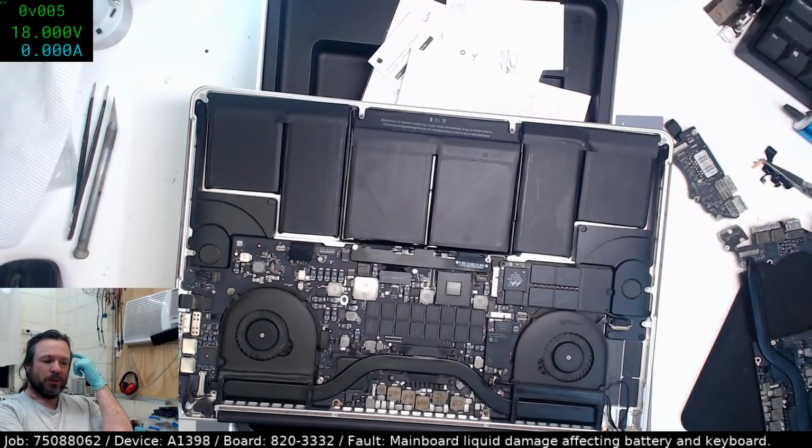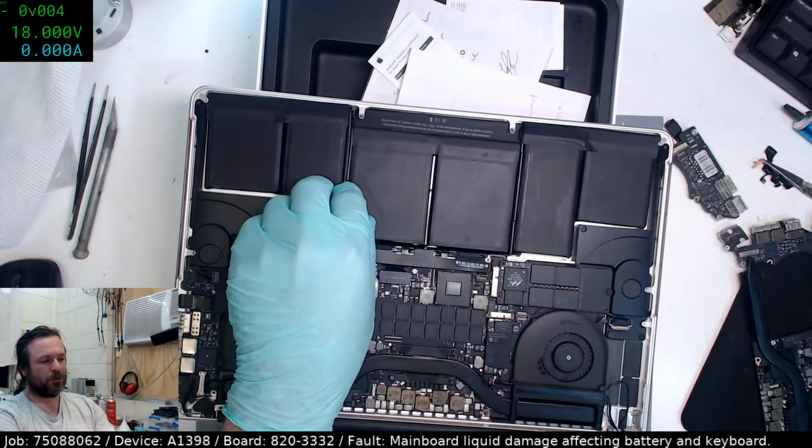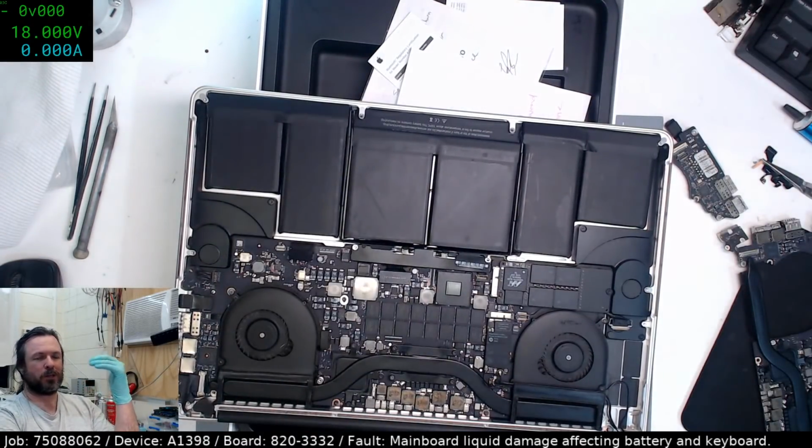You know, the reason why that's slow at the beginning stage is because with lithium packs, when you're below a certain threshold, you can't put the power into them very quickly. You have to go all the way back to about 1/10 or 1/20th charge rate. So if you've got a 10 amp hour battery pack, you don't want to charge anything more than maybe half an amp to 1 amp rate.